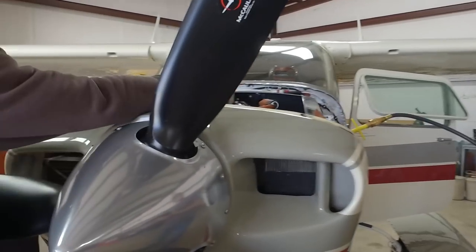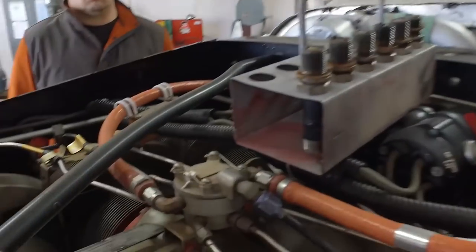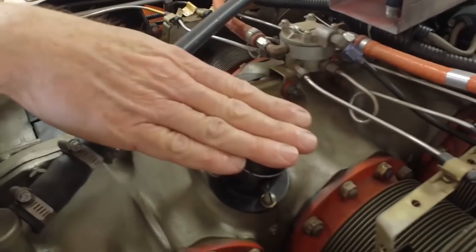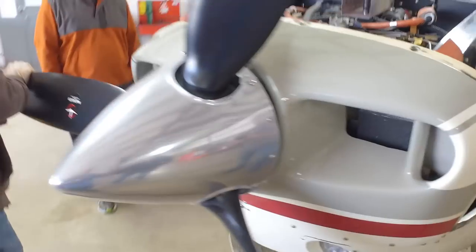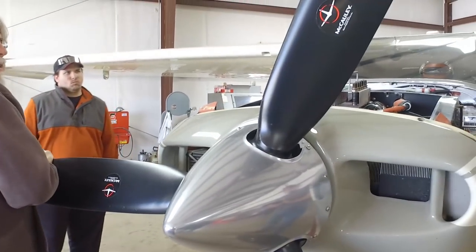Here's what that ring sounds like, okay? You hear that, you know that's all going past the rings and down the crankcase. And what are we at? We're at 58 now. Okay, so we got factory new, which is a brand new engine, all new parts. We got factory reman, which is new standard parts that are at the top tolerance. And we could save about $8,000 to $10,000 going that route. Or we'll just go ahead and overhaul this engine.